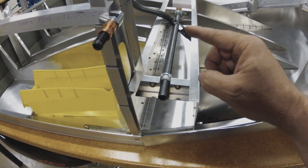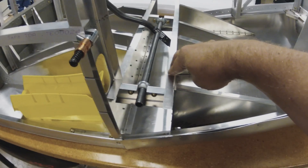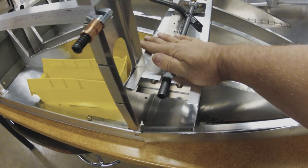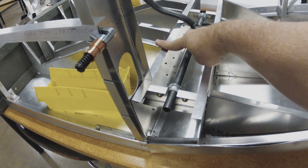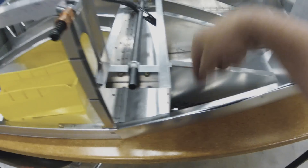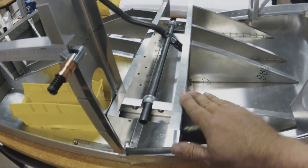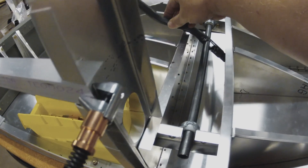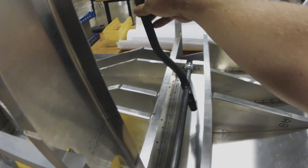People have mentioned that both the A1 and A2 bulkheads — the drawings are not even correct on them. So these are kind of cut to fit. These are six inches tall from the bottom of the skin to match the seat ribs. This one comes up and should be level along here as it's riveted to the front and then onto the longeron as it bends upward. You can see I've started fabricating the control linkages. Tech Shop has a tube bender so I was actually able to bend this rather than having to cut and weld.